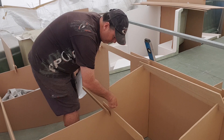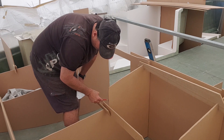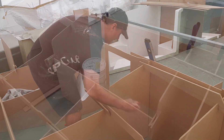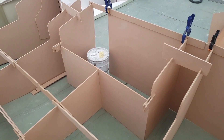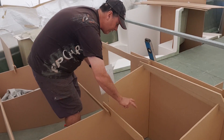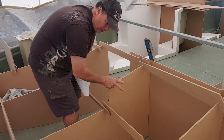That means I've got to remove the centre bulkhead from around here, because this here is the hole for the anchor that goes in through here. So I need to put another one of these wing plates here and another one here, so that this area here is void - that will have a windlass built into it and obviously a chain locker underneath.